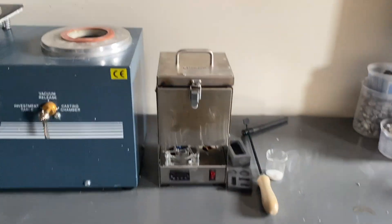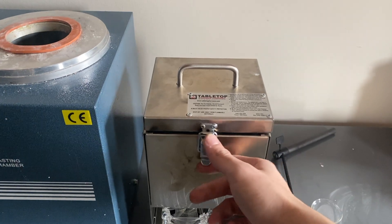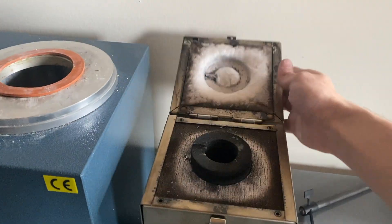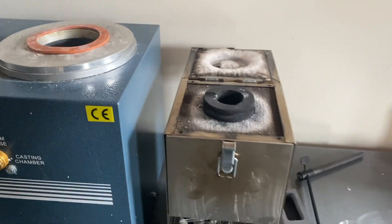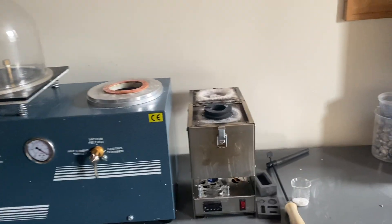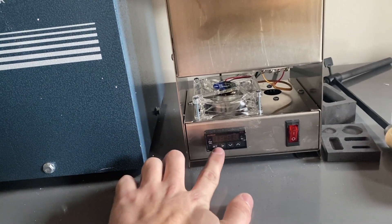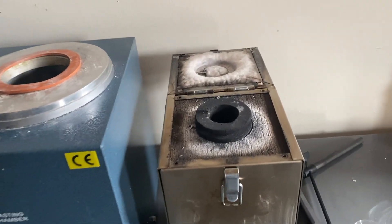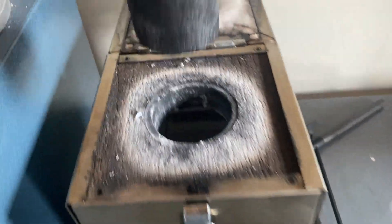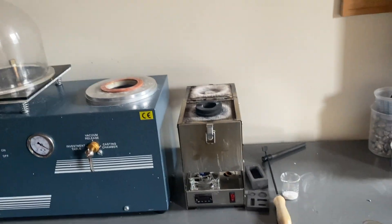Moving on to the metal melting furnace. This is also from the Tabletop Furnace Company — it's the Quick Melt Pro 60. The '60' designation refers to the flask size. You can interchange the face plate to accommodate bigger flasks; I actually have one on order for a 100-ounce flask. It has the same great build quality as the burnout oven because it's made by the same company in a very similar style with the same materials. All the electronics are isolated. You can't program a cycle on this one — you just enter one temperature and it goes there and holds it well. The flask goes in well and easily, there's no damage inside, and just some graphite residue I should probably clean up. This machine works just as well as the burnout oven — consistently, and I really love how well it's built. It's extremely compact and light.